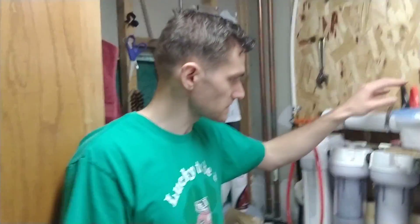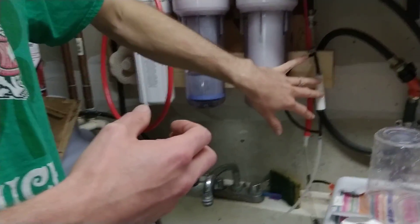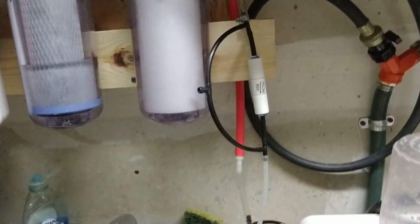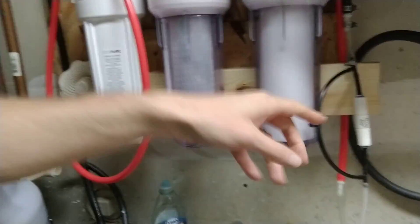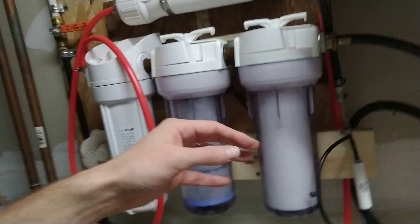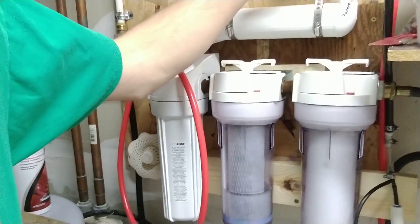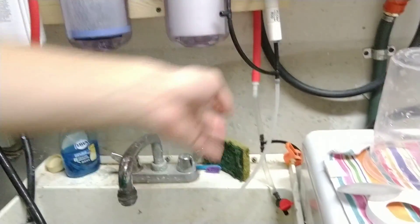Hooked up to this we've got wastewater coming out, which we need to regulate with a flow valve that's matched for the gallons per day of the membrane. I also have a flush valve so I can open this up to full and let as much water out as possible to flush it out every now and then. And then the pure water — that's the red line here — just goes down to a bucket for now, but it will eventually go into the fish tanks directly.